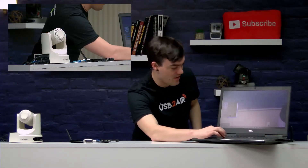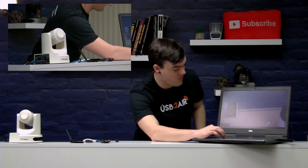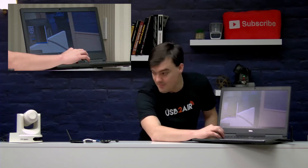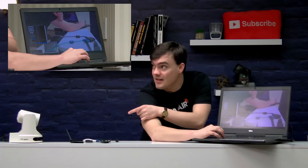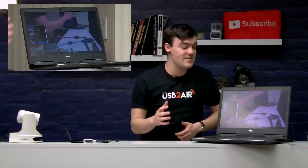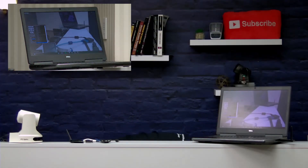Let me give you a live demo — that was pre-recorded but it's the same thing. As you can see, the RokuSoft interface popped up and I am PTZ-ing that camera right there over RS-232 — Sony Visca protocol. I could actually take a joystick like this, using the RokuSoft software, and plug in additional USB control devices using the standard Sony Visca protocol, because this is Visca over USB. We're just making it wireless.